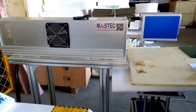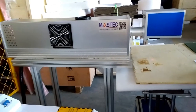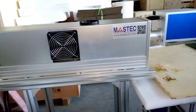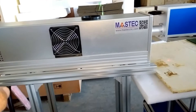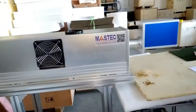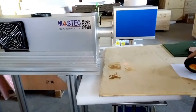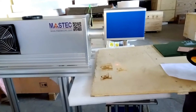In this video we will introduce the working principle of the CO2 laser marking machine. This is the cover box. Inside the cover box there is a laser device. This laser device can emit a CO2 laser beam. The laser beam will go through this way, and the wavelength of the laser beam is 10.6 micrometers. This is a single wavelength.